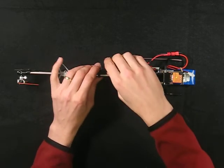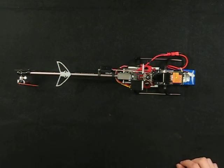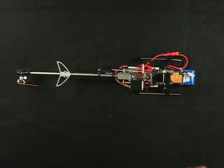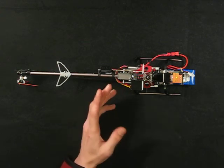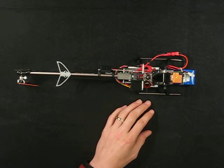Now, the Hyperion servos are all rated to be able to handle up to 400 Hertz. So the highest setting closest to that we can use is going to be 333 Hertz on the BeastX. So we'll get the light to go to blue flashing. Again, it defaults at 50. I think the BeastX errs on the side of caution. All the servos, the default settings are 50 Hertz. So the odds of you burning up a servo are slim to none when you first set them up. So it's kind of nice when you do that.